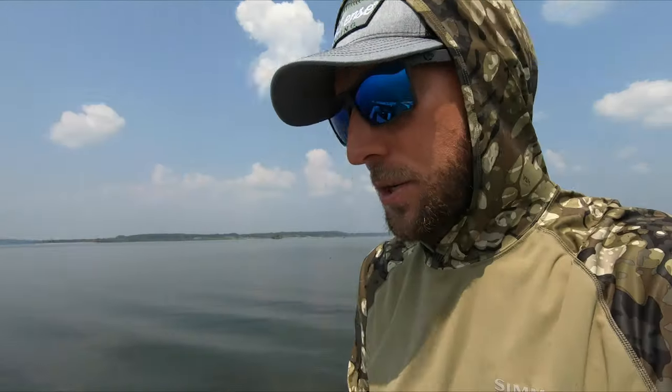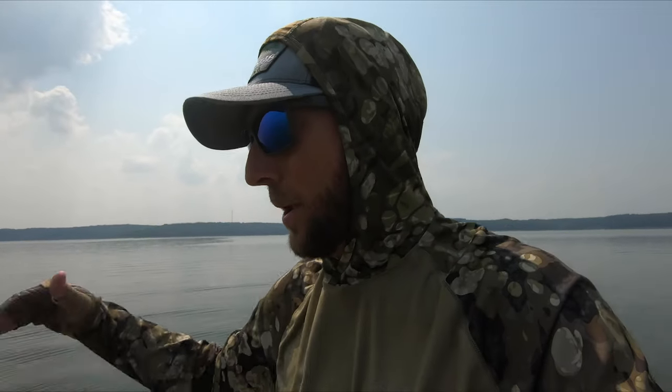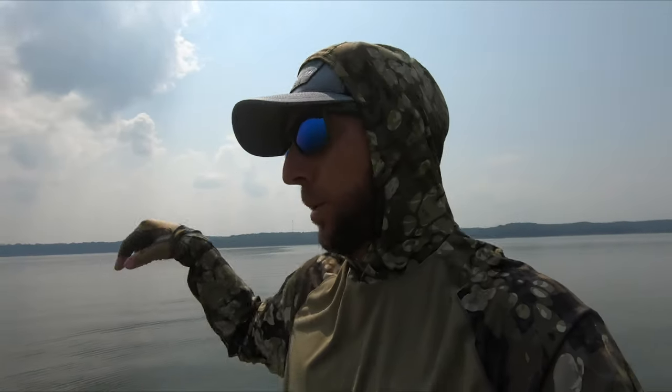Oh, and I guess one more thing that I forgot to mention before everyone starts freaking out about my voltage. I do run my black box and my front graph off of a DeWalt lithium drill battery. I have another video on my channel about that too, but my power is split between the black box and the graph itself. I do not have 20 volts running straight to the graph. You will fry your 18 volt maxed out graph if you run 20 straight to it, but I've got that DeWalt battery powering both my black box and the graph itself. So please don't leave any comments freaking out about the voltage, because it's just fine and I highly recommend that setup if you're in the market for it.